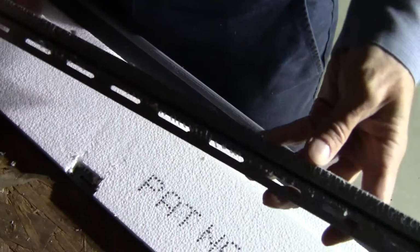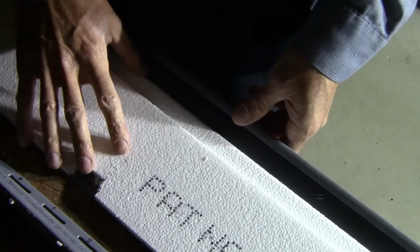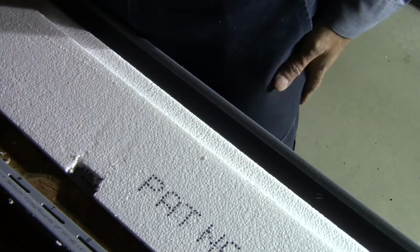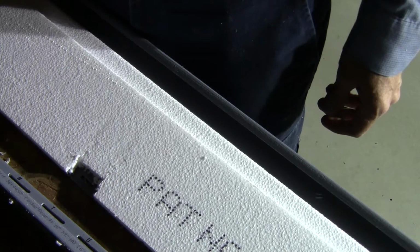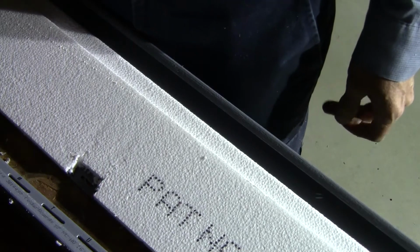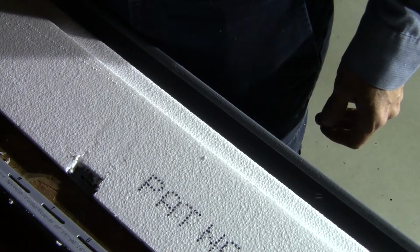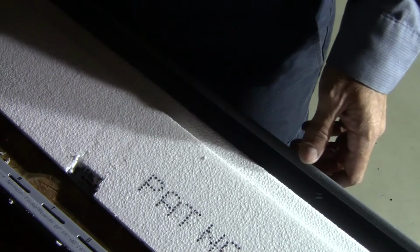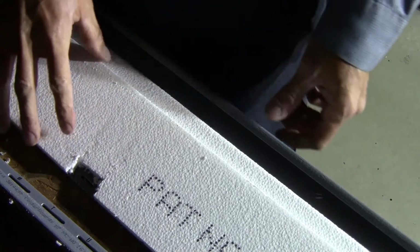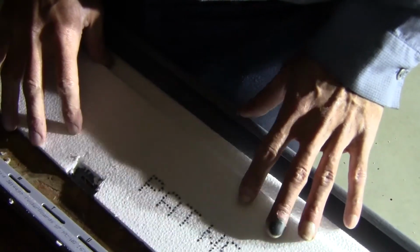So what we're making here is about a 6 3/4 inch piece. This is our starter row to make our second story lines all work out. We measured up a north gable wall, which goes all the way from the bottom to the top, and started working out all of our layouts with our story pole. And it turns out at the second story porch, we need not a full 7-inch piece.